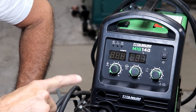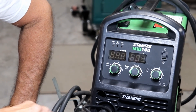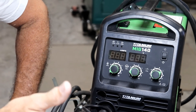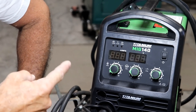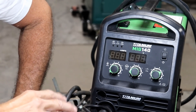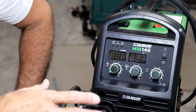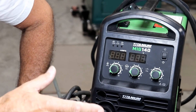I was hesitant buying it because I thought I'd really like a bigger one. But then I got thinking — this machine is so versatile you can take it virtually anywhere on the farm, plug it in, and start welding. It just takes a regular plug-in. A 20-amp circuit is great. I've used it for hours and hours — probably 20 hours at least — and never blew a single fuse or circuit breaker. On a 15-amp breaker you'd probably run into trouble, but on 20-amp it just works great.